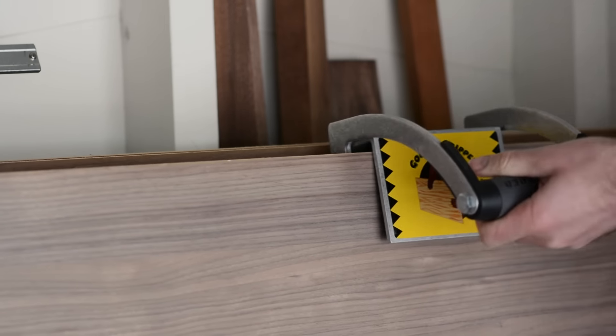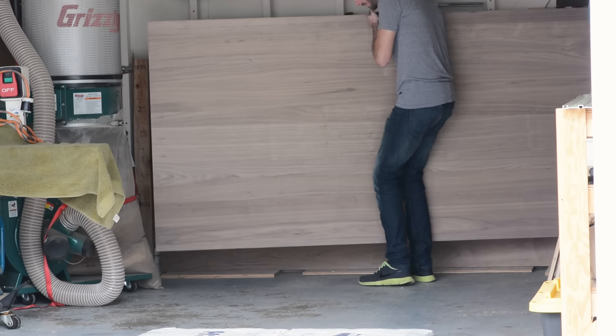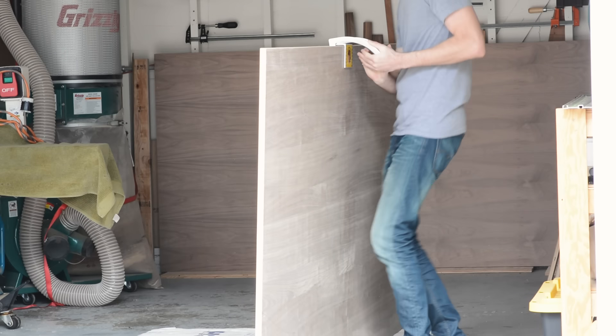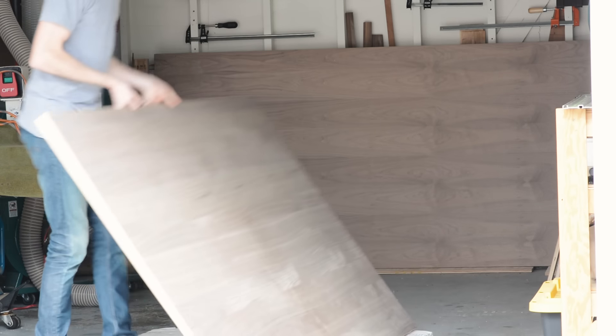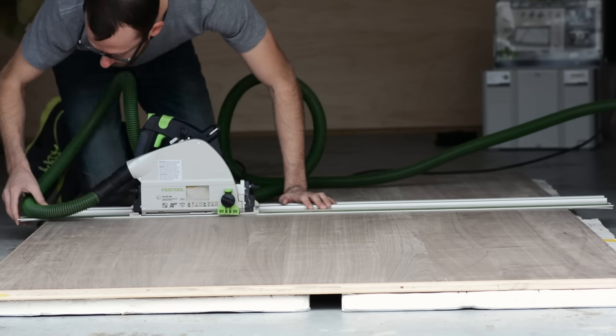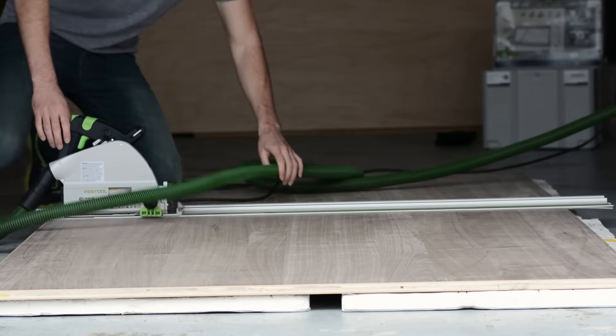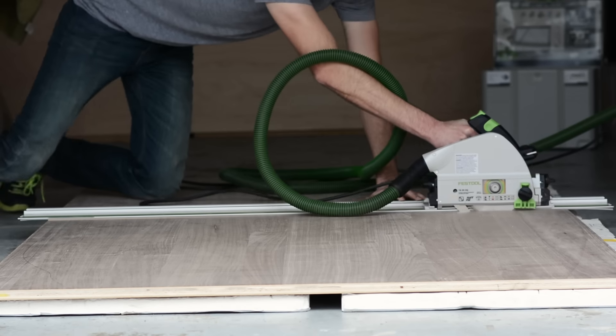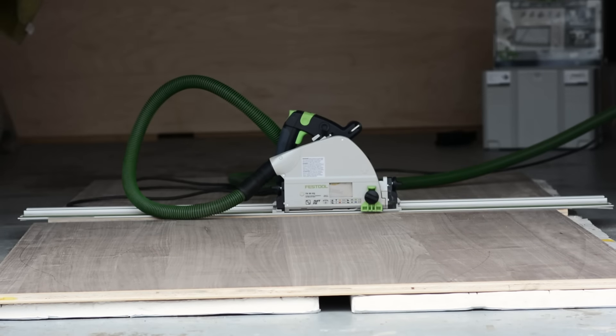If I were using just two tools, I'd go with a table saw over the circular saw. Either way, whichever one you use, just make sure that the blade can tilt to 45 degrees. If you go the table saw route, I'd suggest getting the plywood broken down from wherever you bought it — any store will do it. You could technically do it yourself on a table saw, but it would get a little unwieldy and you'd need a lot of room.